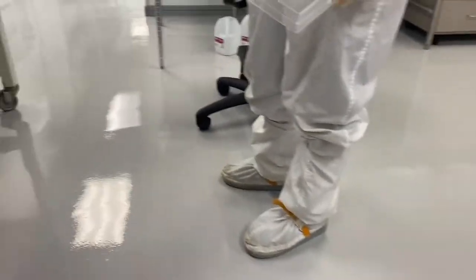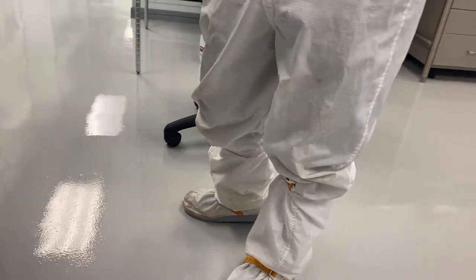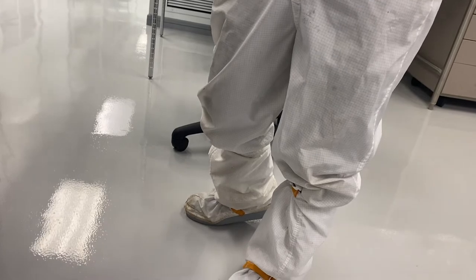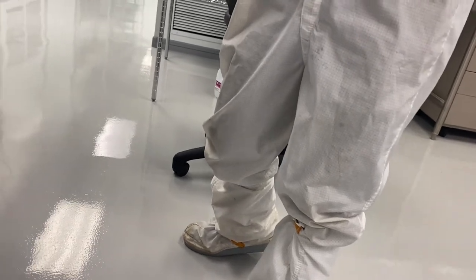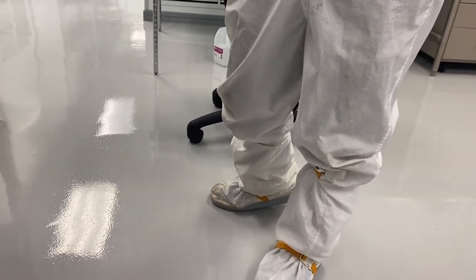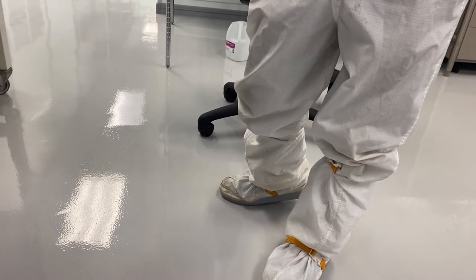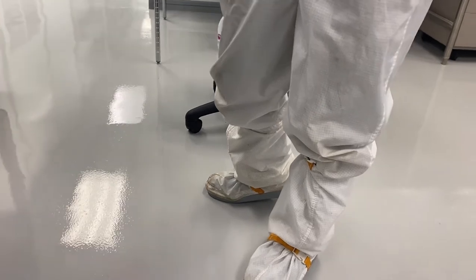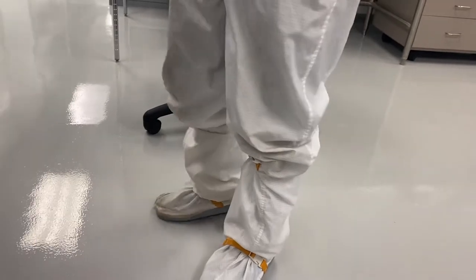It's really annoying when you don't check and you do lithography or you're trying to clean your sample and you get to the point where you need nitrogen and you find out it's not on. For example, if you drenched your sample in acetone and you don't dry it right away, it'll evaporate on your sample and that will cause dust and other things to accumulate there. Then you'll have a really weird pattern and you're going to have to redo it.